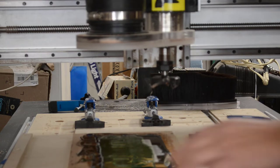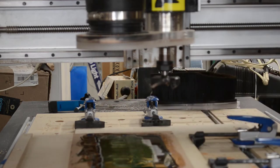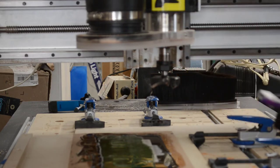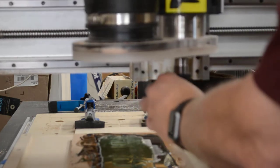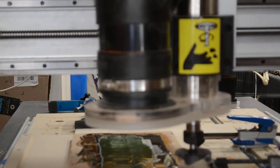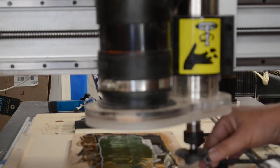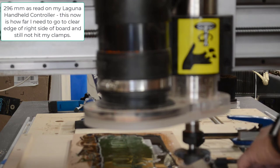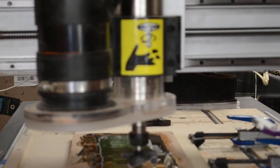I'm going to measure the Y axis first. I'll come down close and out enough that I won't be hitting my clamps. I know that 296 is my farthest X axis. Then I come to the left side of the board and I know that is 84. So I want to be between 84 and 296 when I'm making adjustments. That will become clearer in a minute.